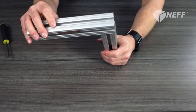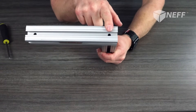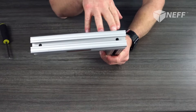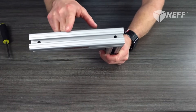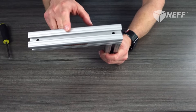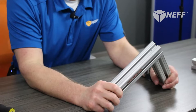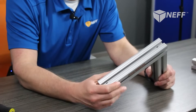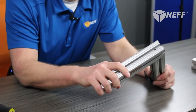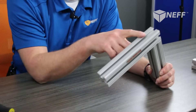The only thing to keep in mind with the end fastener is that pre-drill access point. You can put this end fastener anywhere along the bar in that T-slot, but anywhere you want to be able to tighten it down, you have to have that access hole. So as a recap: this is the end fastener — fast to assemble, very strong hold, and cost-effective. Just keep in mind that it's non-adjustable.